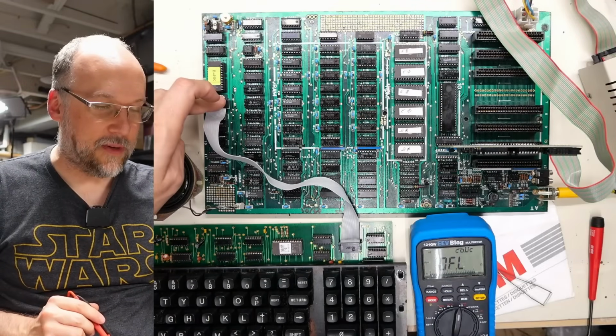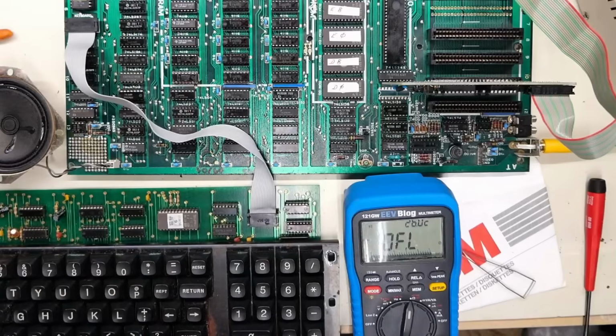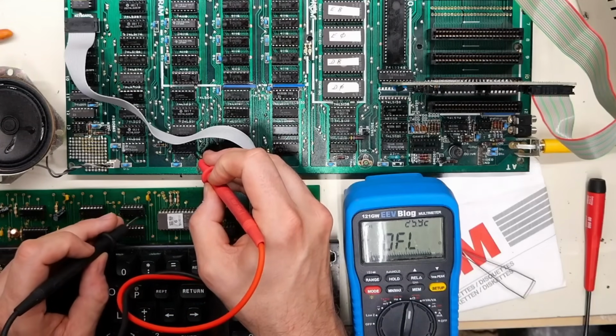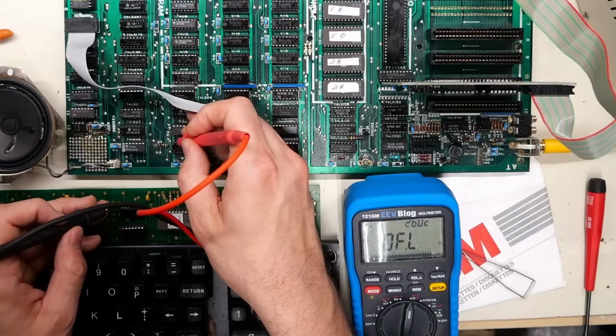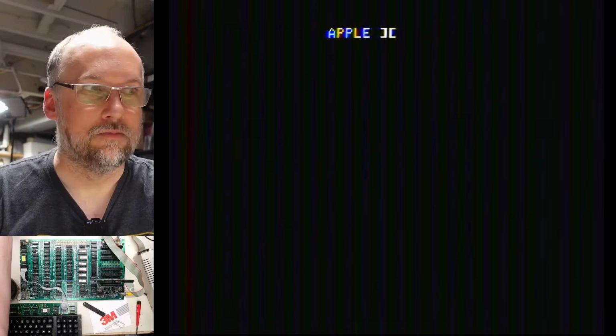Okay, connector is swapped out. I used one of those round hole type, so I had a nice firm connection there. It's connected up. Let's see if the TTL ground pin now makes its way to these chips. It does to that one. And the 5 volts? Yes. Okay, excellent. Let's turn on the power and see what happens.